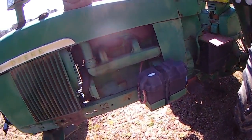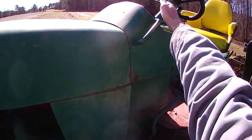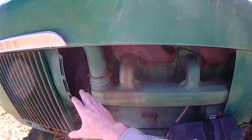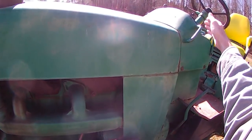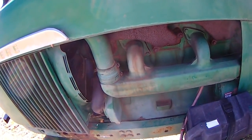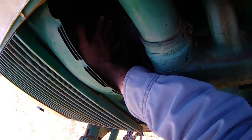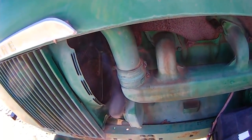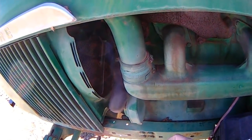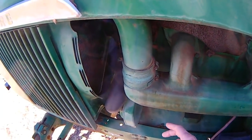Let me show you another use for this — let's walk down here to the 40-20. A practical use: the old way, if I thought by the temp gauge I was having a problem with cooling the water and antifreeze, I'd run the tractor, see the temp gauge climb up, and figure maybe the radiator is partially blocked. You'd have to turn it off, then stick your hand back in here and move it around on the radiator looking for warm spots and cold spots. A cold spot means that portion of the radiator was blocked and you weren't getting water through it to be cooled or have the heat transferred out.